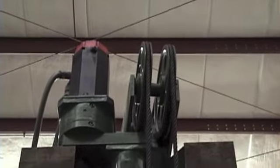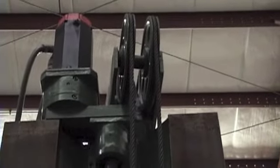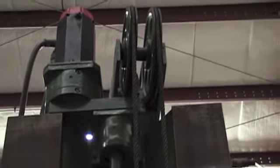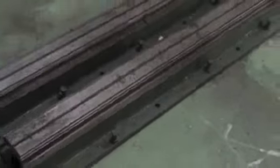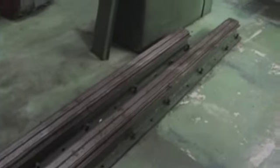This is at the top of the machine. The servo and the pulleys will all be taken off for shipment and will have to be reassembled at the site. The counterweight is inside the column and will also be taken out for proper shipping. When putting in the outriggers, they must be at the floor level.